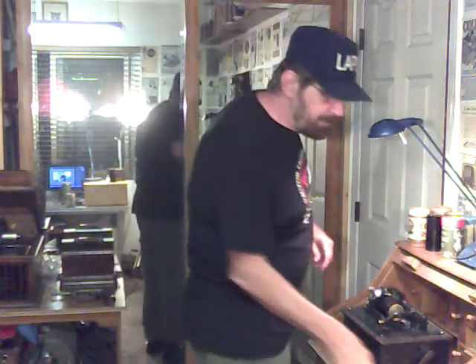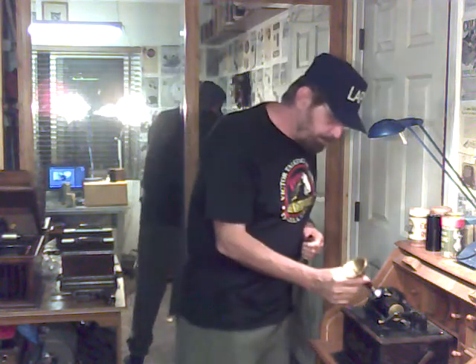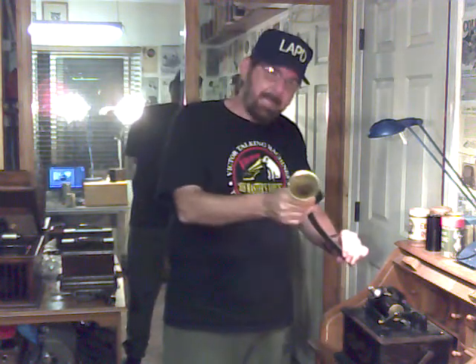I really prefer the speaking tube. Any recording I make of my voice is with a speaking tube, always. If two people want to talk at the same time, you have two speaking tubes with a Y connector plugged onto the recorder, and you can both talk at the same time without losing anything. Speaking tubes are really the way to go — they make really great recordings. The neat thing about the speaking tube I built is you can pull the bell off and put it directly on the machine as a little horn, which is reminiscent of the cylinder tin foil phonograph. It's great for field recording without having to carry an additional horn.